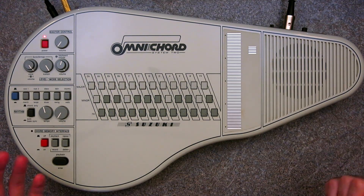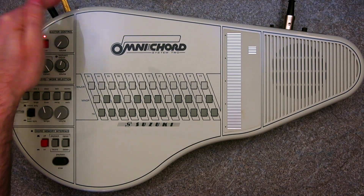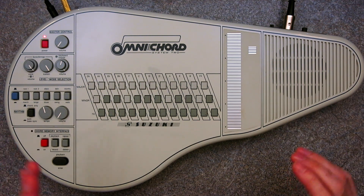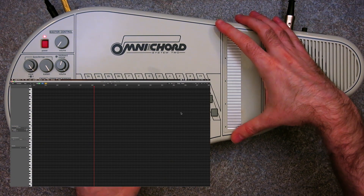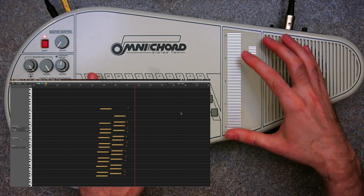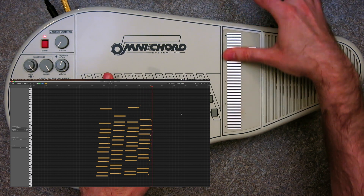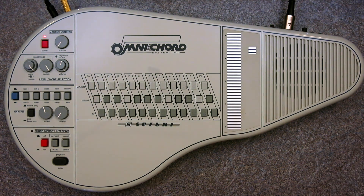It's just an analog envelope, so the more you turn that up the slower the envelope will release. I've got a headphone plug in this at the moment just to make the speaker quiet. We needed to emulate that action by using a timer routine in the software. The problem I was having before was that notes would get stuck, especially if I change chord.